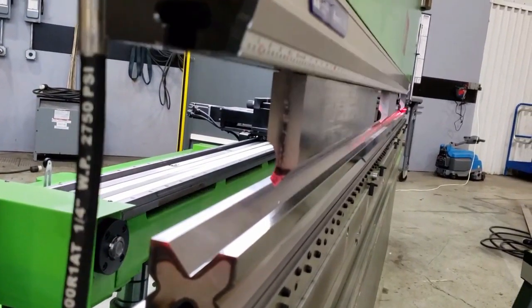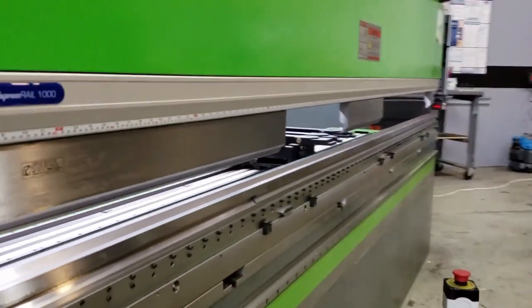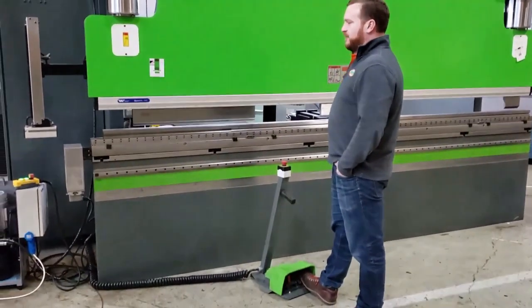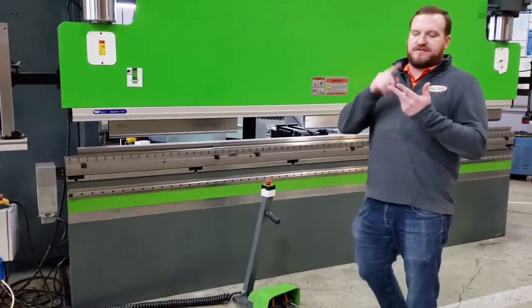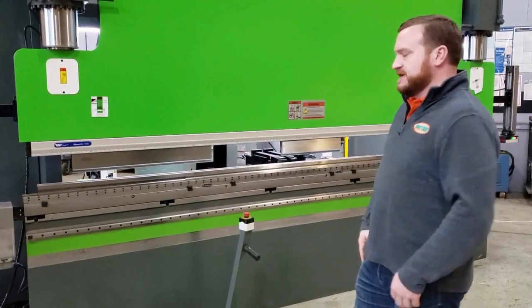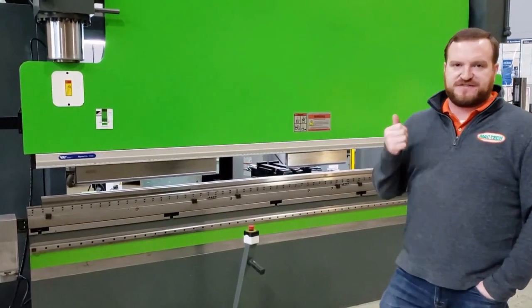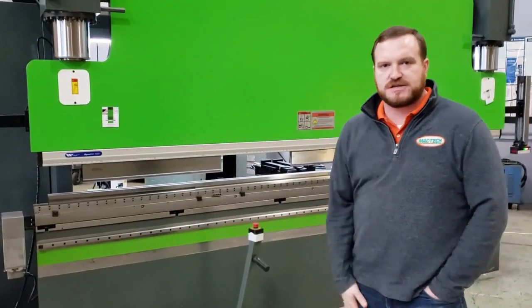We're getting 472 inches a minute approach all the way up to 2 millimeters from material thickness, a 40-inch per minute bending speed, which is about twice the production speed of a hydraulic press brake, and a 400-inch per minute return. We can offer that speed, that efficiency, that accuracy all the way up to 286 tons by 14 foot. This machine is a 193/12. It'll do 1/4 inch full length. It'll offer the highest production, the best efficiency wall plug, the least maintenance, the highest production at the lowest cost, only from MacTech.